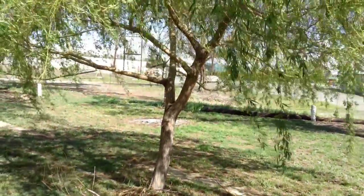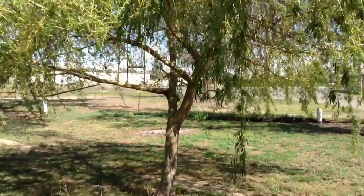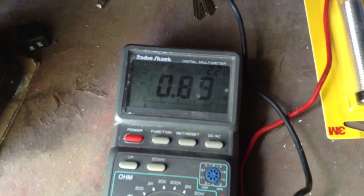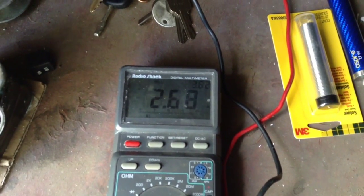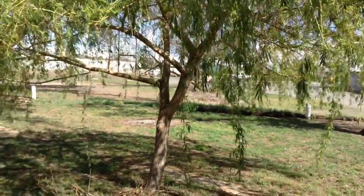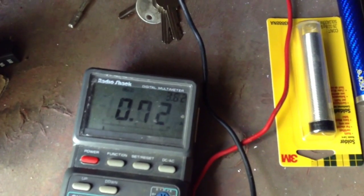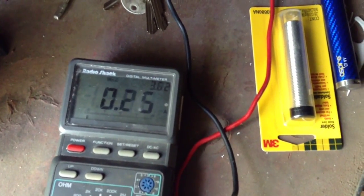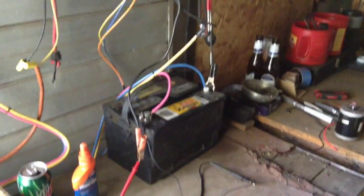The wind's blowing nice and hard out there right now, but it's just not catching the wind where it's blowing from. That's my highest reading of the day. So if I take the coil set from three and knock it down to six, the amperage should go up quite a bit, plus it's going to be spinning a lot faster. In theory, if I just hit three amps there, I should be able to hit 10, maybe 12 amps after I rewire it. So if I hit 10 amps, that's 120 watts that would be going into my battery bank.